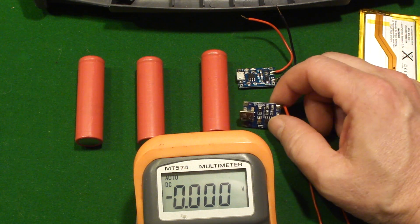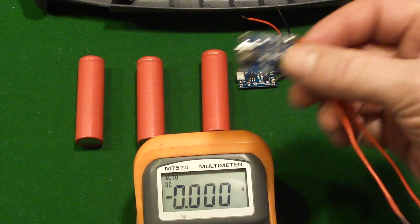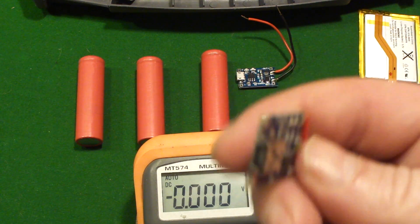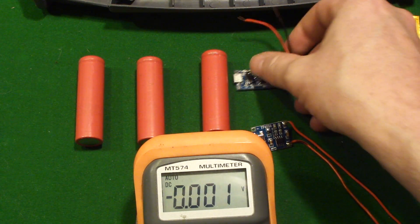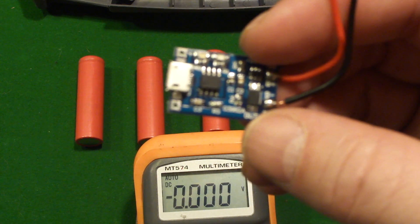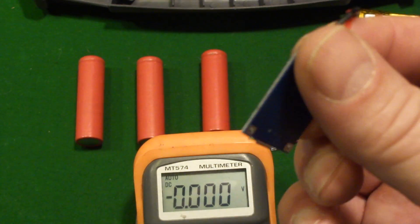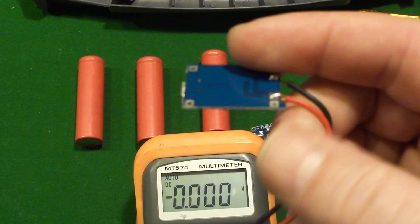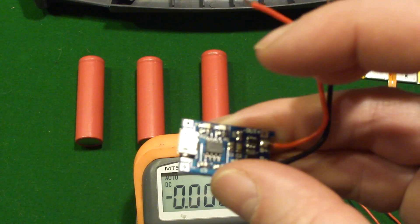These modules manage all of that for charging. This one is a TP4056 — very good for charging batteries. These are the older units, USB capable. But I like these ones — these are 03962As, and they will both manage the charge and discharge. At 50 cents a pop, you can just throw them in your projects and largely forget about it.